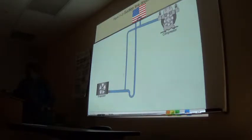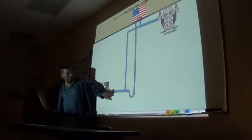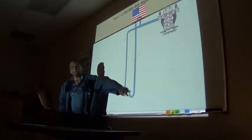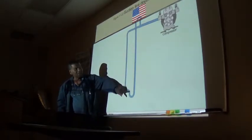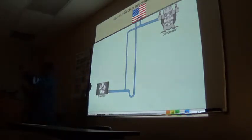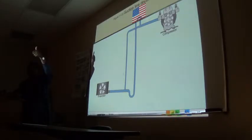So, see what I was just telling you guys? You have a big line here going up, and it's going to be pretty tough to get all your oil up. So two little lines, higher velocity. Once you reduce the line size, you get higher velocity. Higher velocity will pull more of that oil up without any problem.